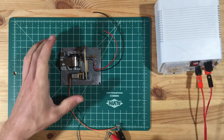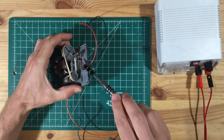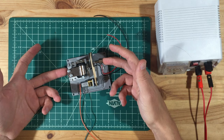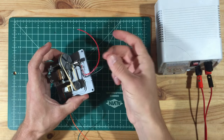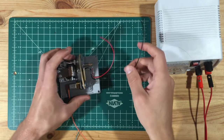Awesome, it sounds great. So you may have been wondering what these wires are for, and I mentioned in the beginning that we need some way to count rotations. I'm using the body of the music box as a switch. When the handle touches this little bent piece of wire, it bridges this red wire to this black wire, which is screwed to the body of the music box.